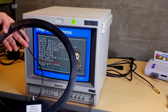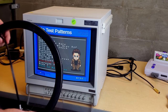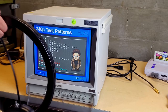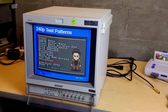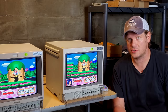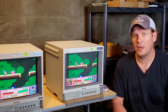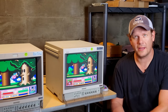Now that interference could have come from some kind of magnetism that the monitors experienced while in transit. And this is why this degaussing coil is something that I have never regretted buying — it's an amazing tool. I've had it for probably six years. I got it from Fry's Electronics before they went out of business, so I don't know if these are easy to get anymore. They are way bigger than some of the small ones that are just a little hand wand, and they have way more powerful degauss output. The magnetic field is bigger and more powerful, and it does get extremely hot after you use it — like a hairdryer. Thankfully I was able to clear up a lot of the purity issues just with that simple degaussing tool. I realize a lot of people are not going to have that tool, so if you come across a monitor with these purity issues, you might have to find somebody who has one, bring it to the shop, and get that degaussing done. Or you may have to invest in your own degaussing coil tool.